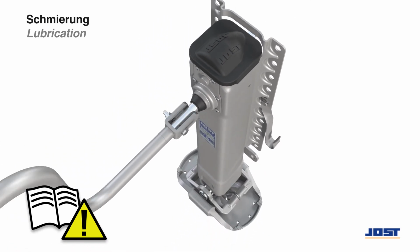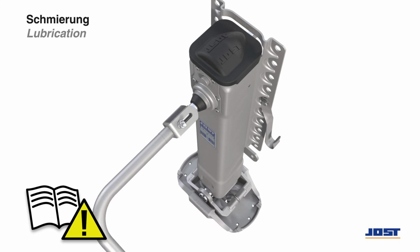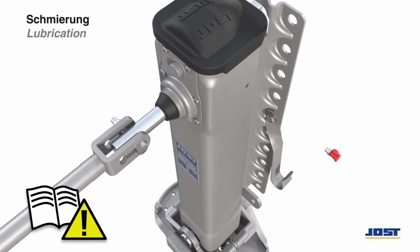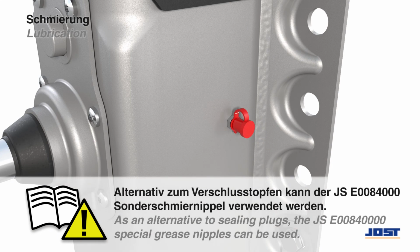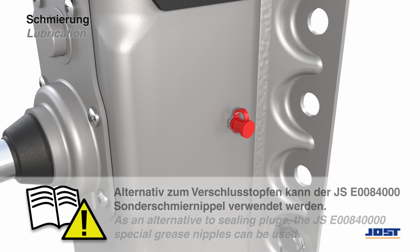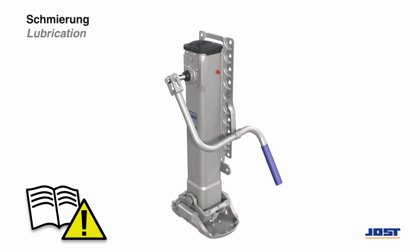Wind the leg in until it's fully retracted. Wind it in and out once more, and then close the lubrication hole. Module CS landing gear is the only exception, as it doesn't require lubrication.